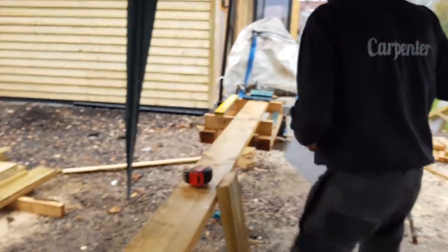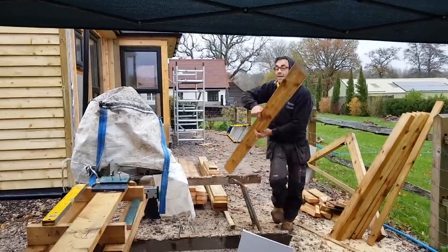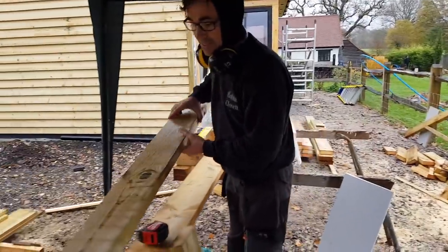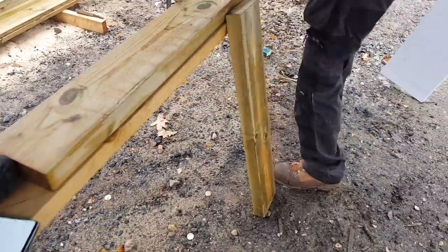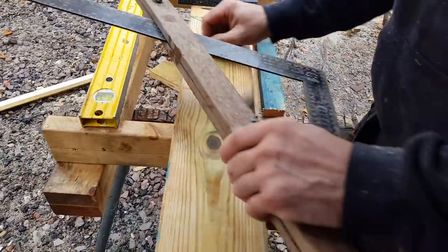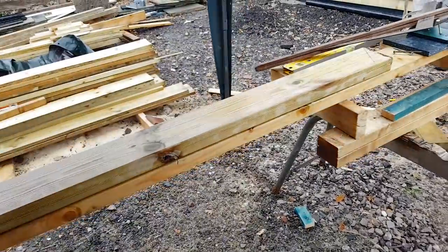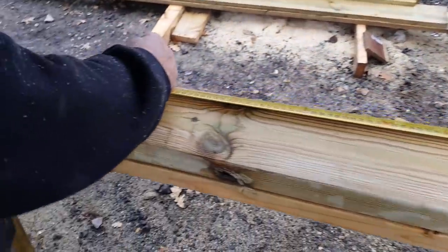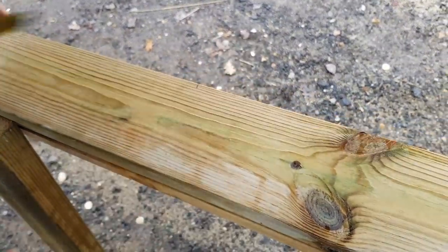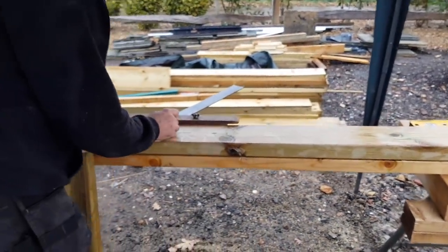All I need to do now is get a rafter. I'll get a piece of timber. I'll take a nice straight one, because this will be a template, of course. We'll put that on there. We'll mark a plumb cut at the top, right on the end here. There's my plumb cut, I'll write PC there. And I'll measure my rafter length right off the end, because that's why I did it on the end, so hook the tape on. 988. I'm going to go 988 there. Another plumb cut there. We have it there.